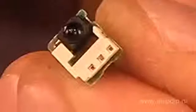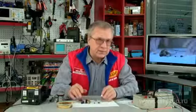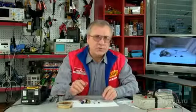The structural circuit of a photodetector includes a photodiode and an integrated chip. The latter performs the function of automatic regulation of the gain level of commands received by an infrared photodiode. The chip and the photodiode have a screen. Many structures have an external metal one.